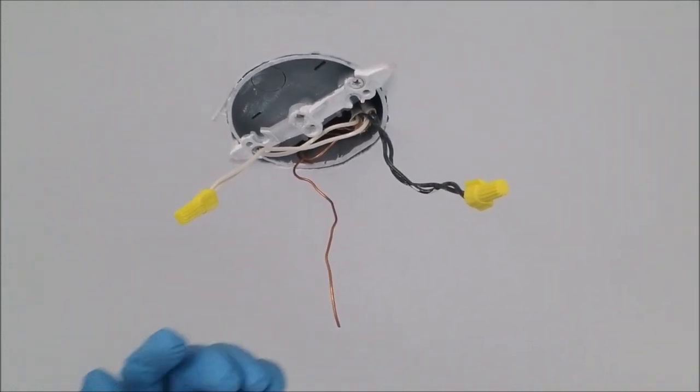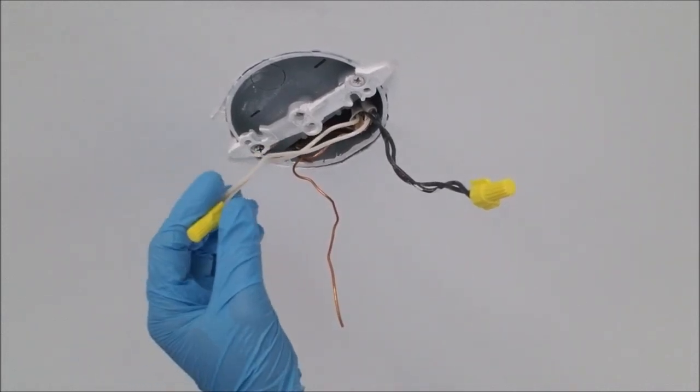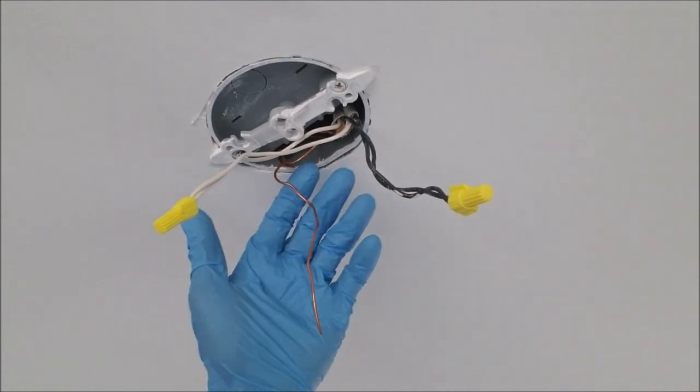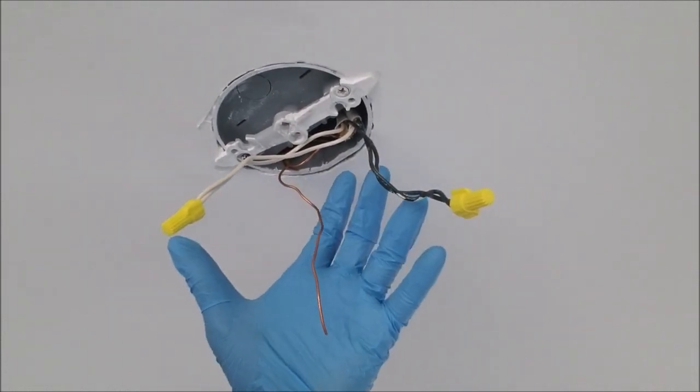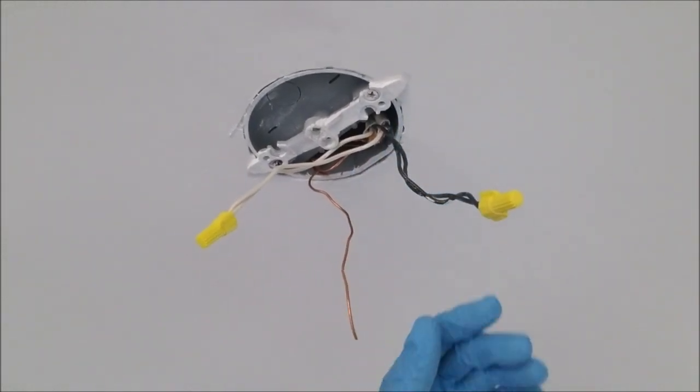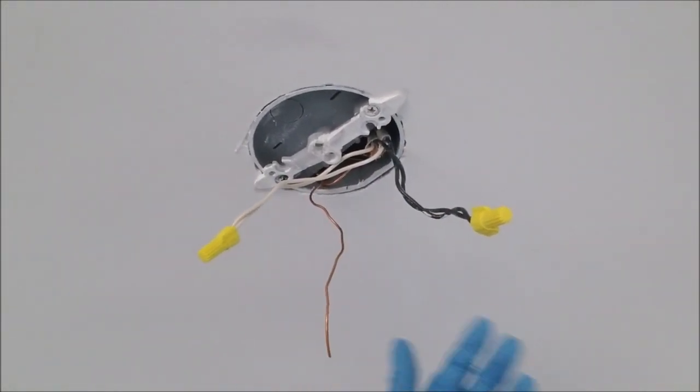The reason why I shut off the power after I pull the wires out is because I don't want to dig in here and explore for wires when there may be one exposed and live — that would be putting myself in harm. So I turn the power off, take the wires out, turn it back on, then test, and then turn it back off.